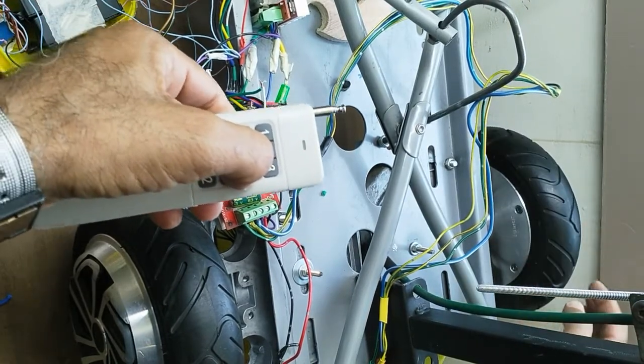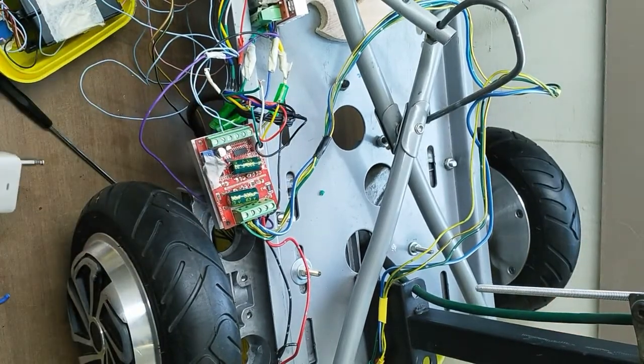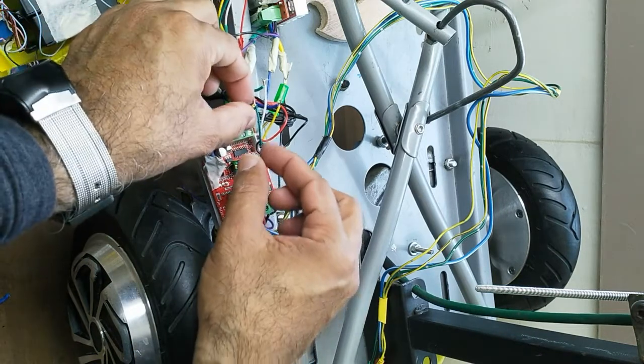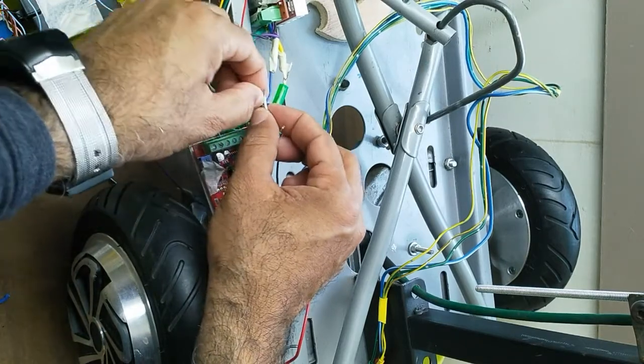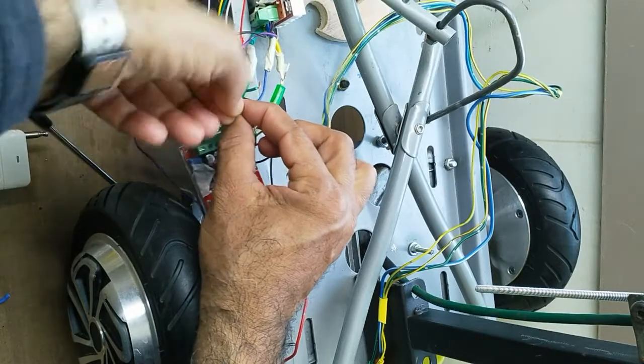The combined force also makes sure that a BLDC has a constant torque nature. BLDC motors have a trapezoidal shape and are commonly controlled by trapezoidal control. Trapezoidal control is six-step commutation, commonly used in high-speed applications or where higher starting torque is required.